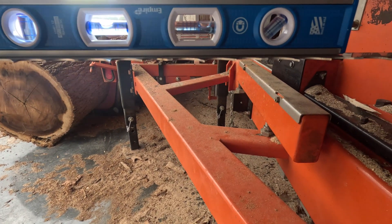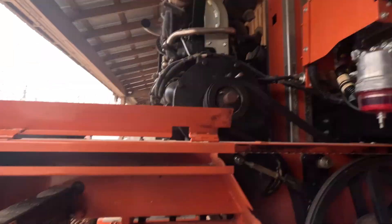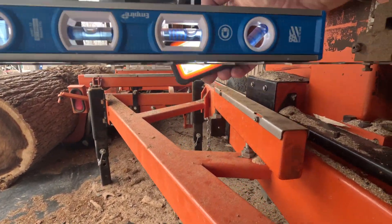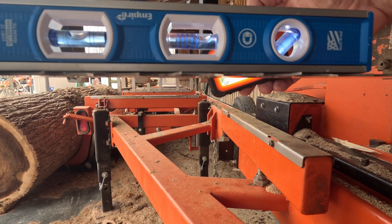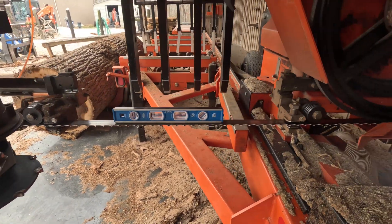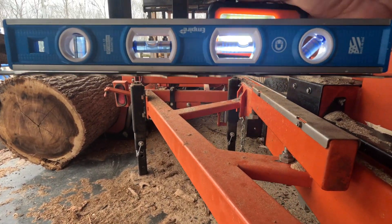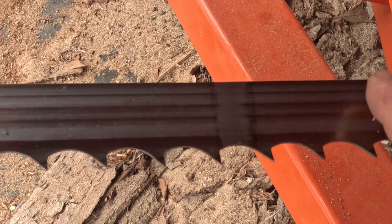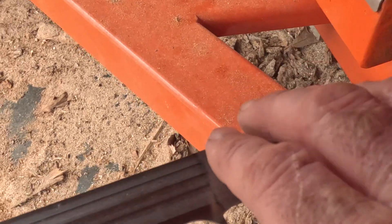I don't know if you can see this, but that's how you check it. This is a simulation of a bad weld. Notice I've got two sunglasses on so I'm concentrating. You put the light behind it and you can easily see daylight — see that streak between the level and the band? That would indicate a poorly ground weld. It says something that in order for me to demonstrate a poorly ground weld, I have to simulate it on this band. When I rub my finger over that, I almost cannot feel it. It's just dead smooth. It's that good.